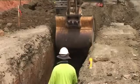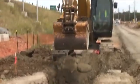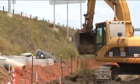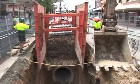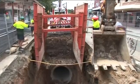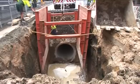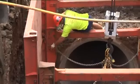The excavated material that is suitable for backfilling should be placed securely and as near to the excavation as is safe, so as not to fall back into the trench. Trench shoring in unstable ground is mandatory from a safety aspect, as is the proper installation and removal of the shoring elements. Remember, take care on site at all times.